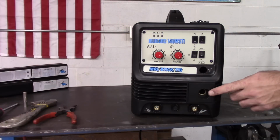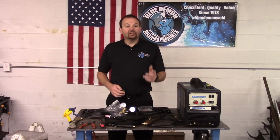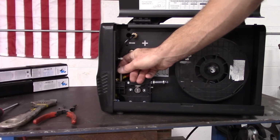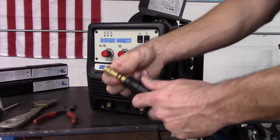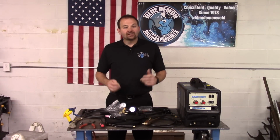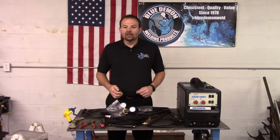Here you can see the port where you insert the cable into the machine. Use the 5/16 deep well socket to loosen the retaining bolt. I lubricated the O-rings very lightly with soapy water before installing. Once you have the cable pushed all the way in, tighten the retaining bolt. Finger tight should be fine.